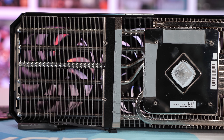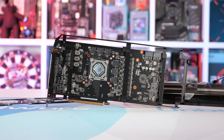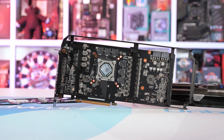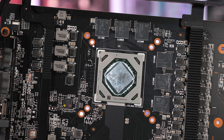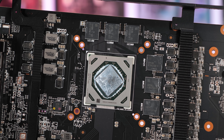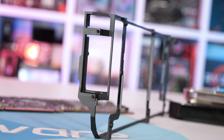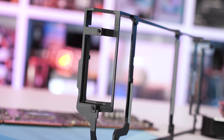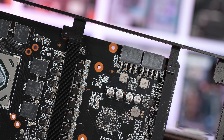Because this is such a big, heavy cooler, a major concern is how you go about mounting it to the PCB, and we've seen this isn't always something ASUS has done a good job of in the past. It seems they have learned from past mistakes by firmly securing the VRM portion of the heatsink. To ensure that the PCB doesn't flex, ASUS has developed an aluminum brace that connects to the PCB in several locations, as well as two anchor points on the IO bracket and two at the far end of the backplate. ASUS has also used this large aluminum brace to remove heat from the left bank of power stages and the right bank of inductors — quite creative.